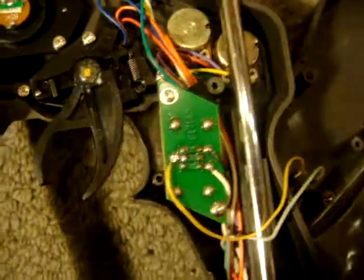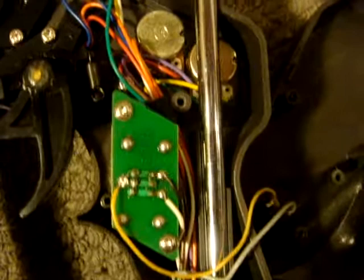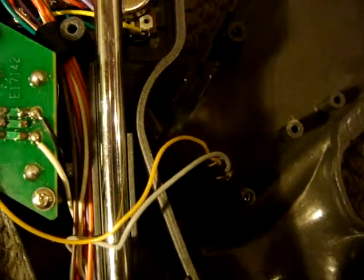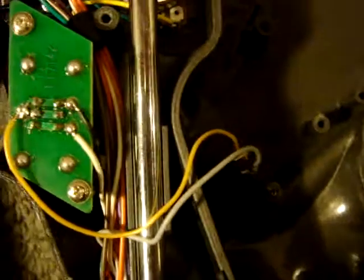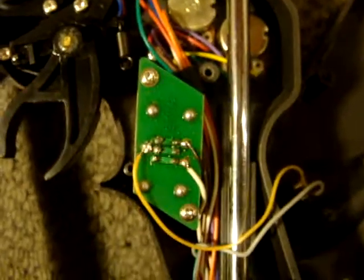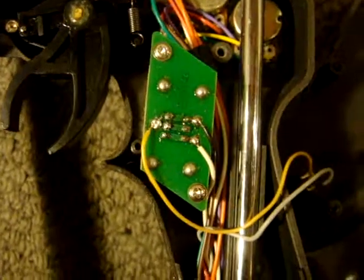Basically the button is now acting like a breaker — it's an off-on switch. The toggle switch is deactivated, which means your servos are centered and they stay centered until that button is pushed. So if it's set for R for run, when you push the button it'll activate and move in the direction to trigger startup. If it's set to S for stop, when you push the button it'll move in the direction to stop the vehicle. That's how you take advantage of a single channel to actually do two functions, which I think is pretty cool.